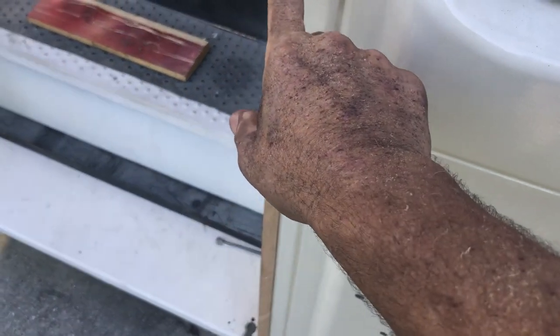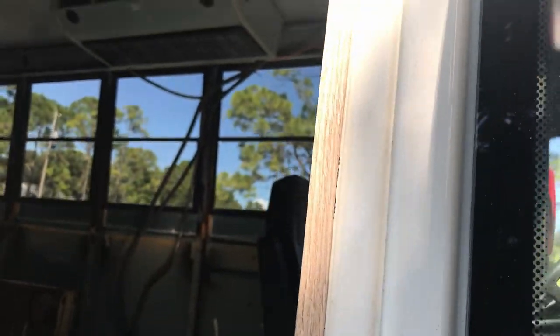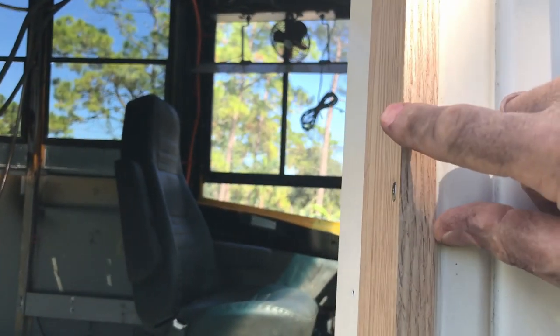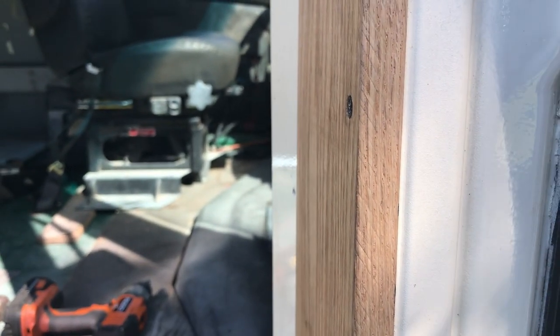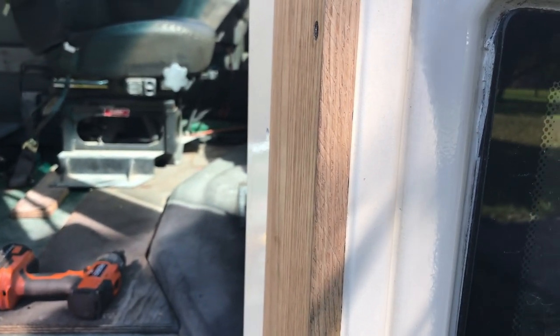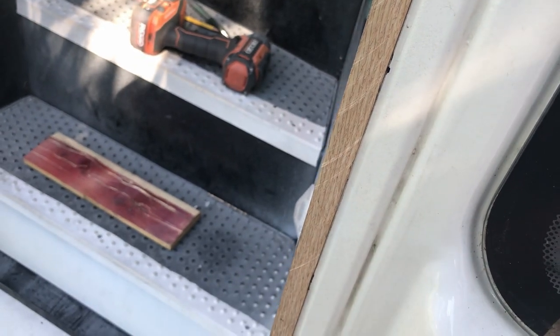It's in there like swimwear now. What I'm gonna do is take it back off again and smooth out this edge, because it's just a table saw cut and it's also curved — pretty rough. All I've got is the block plane and an orbital vibrating sander. Then I'd like to round off this edge with the router — put like an eighth-inch radius on it. Actually, I think I'm gonna save the radius for now just in case my plan changes.